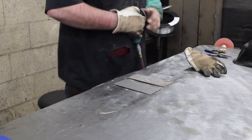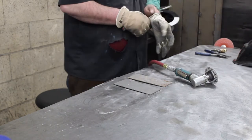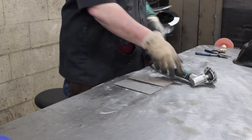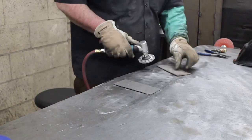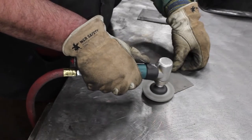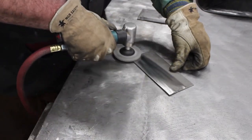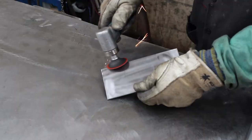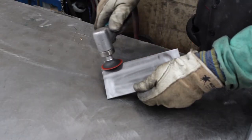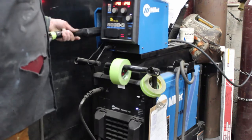Metal prep: unlike stick and flux-covered electrodes, which have higher amounts of special additives, the solid MIG wire does not combat rust, dirt, oil, or other contaminants very well. Use a metal brush or grinder and clean down to bare metal before striking an arc. Make sure your work clamp connects to clean metal too, as any electrical impedance will affect wire feeding performance. To ensure strong welds on thicker metal, bevel the joint to ensure the weld fully penetrates to the base metal — this is especially important for butt joints.